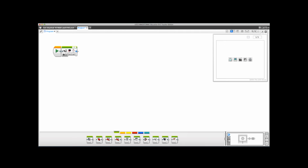And basically this allows you to try and sync the servos so that they move to position either as fast as they can or at another speed if you want that. Again, 0 being as fast as it can, and then 15 being the slowest amount. So if you need to slow one servo down versus another, you can try and play with the speed a little bit and make sure that they arrive to the same position at the same time. So that's the servo block.